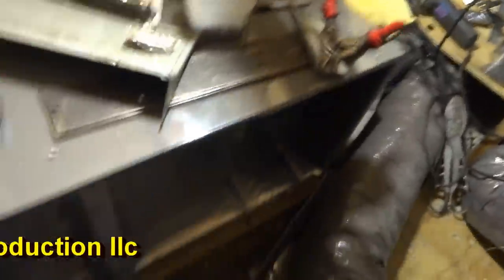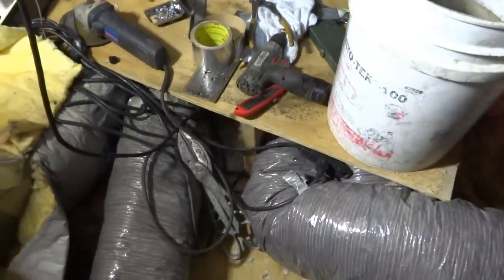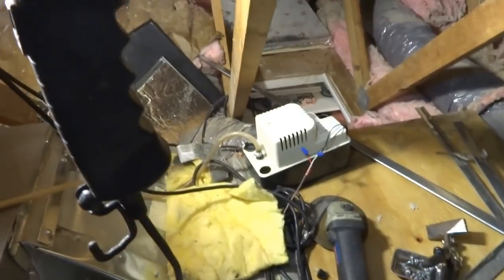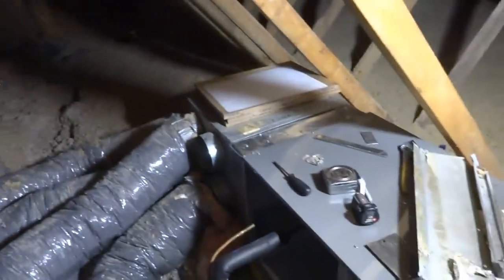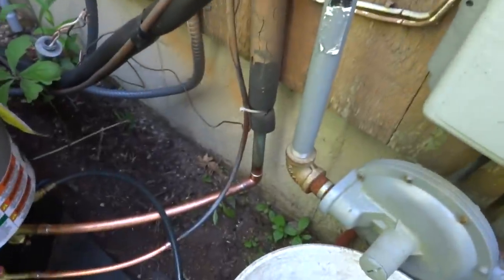The only way to get it up here is to take it apart. I'm gonna reuse the pan — this platform will be fine with it. I ended up cutting it, folding it up, putting the S-lock and extending it with a couple of scab pieces. I'm gonna tape it up really good and wrap the return. Good thing I put all this wood up here. I put a couple of S-locks in that gap so when this thing pulls in it's gonna be tight.